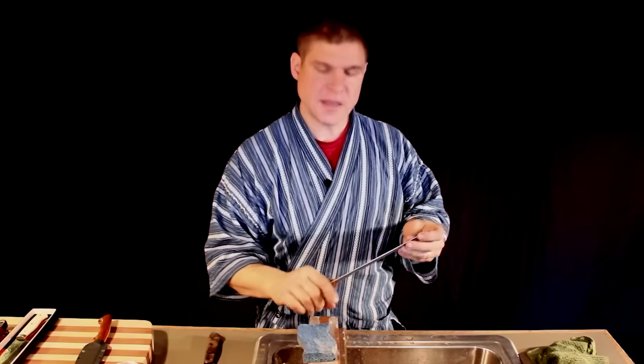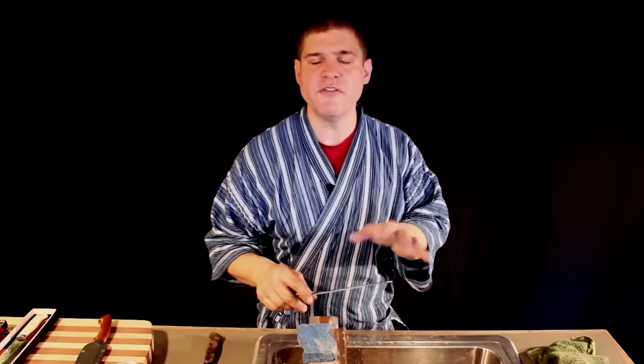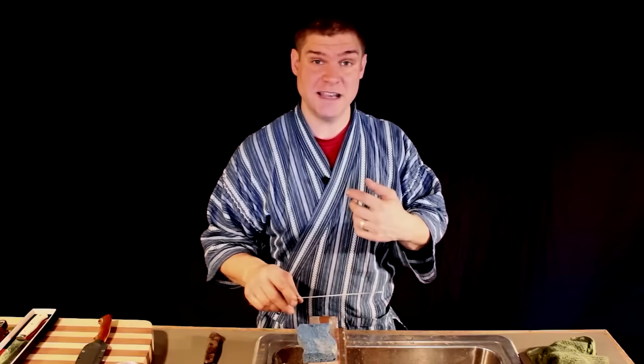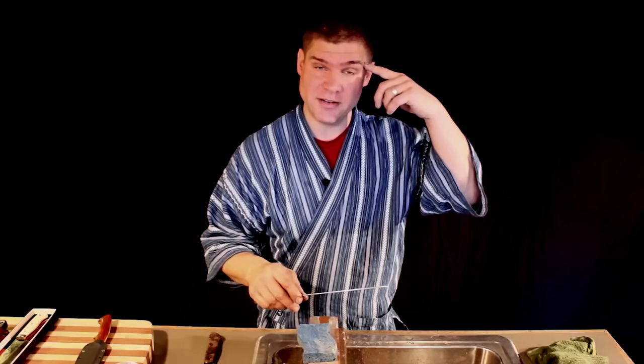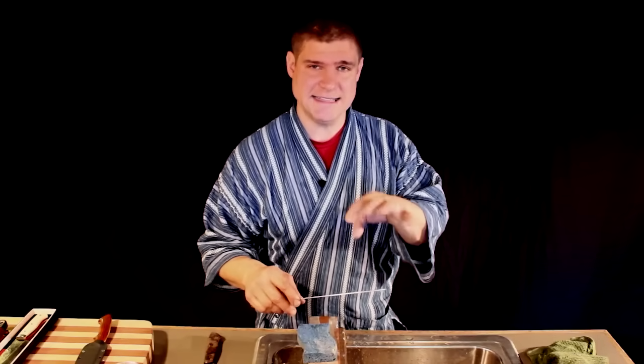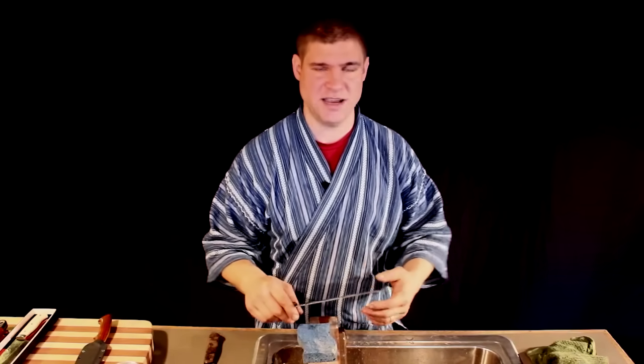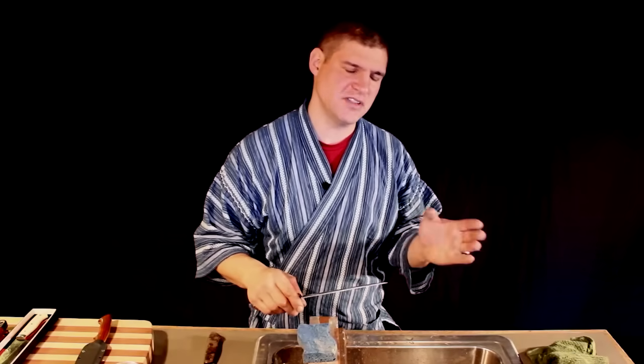So let me say that there's no such thing as a perfectly straight knife. When I think of straight, I think of a laser beam, and when I make my knives, that's the ideal I'm aiming for. As a matter of fact, I sit down at my straightening station, which is a round stump with a brass hammer, and I straighten my knives about 7 or 8 times between the time I start forging the blade to the time it gets delivered to a customer.